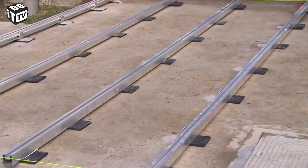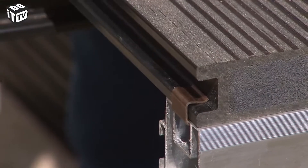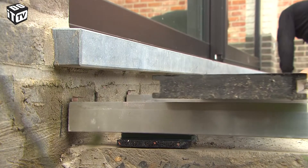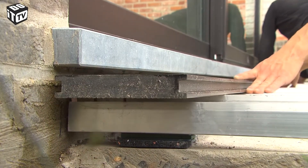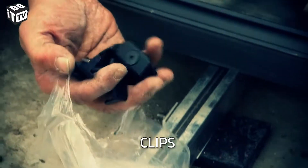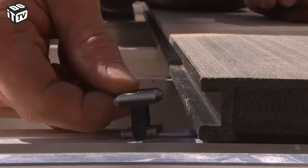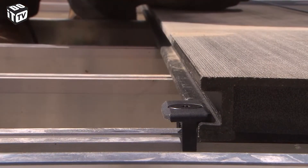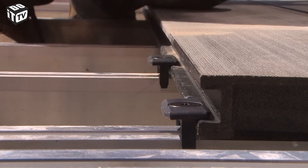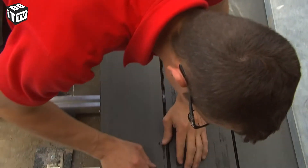With all of the bottom beams in place, you can install the first composite board. Slide them into the end clamps you've applied before. In order to complete the installation of the boards, you will need an electric screwdriver, the clips, and a hacksaw. The other rows need to be fixed with plastic clips — slide them in between the boards and screw them down with the drill bit included. This is work that moves along quickly and you will see your terrace evolving rapidly.